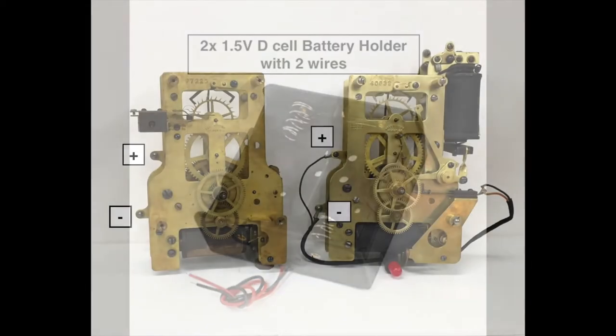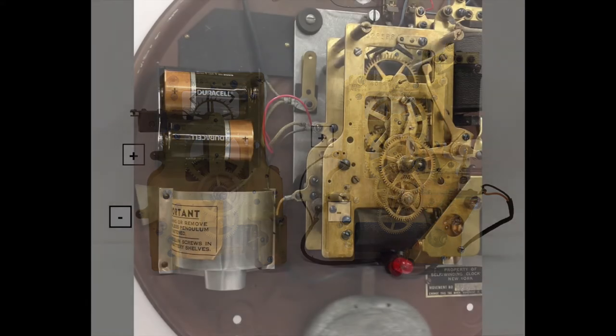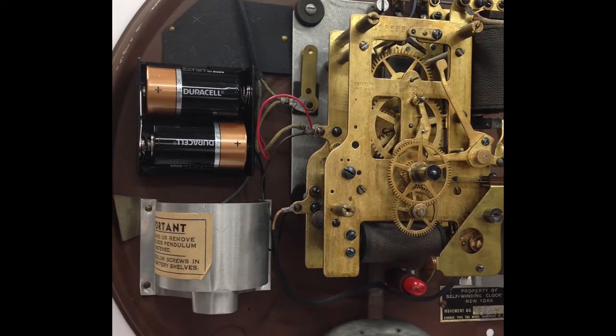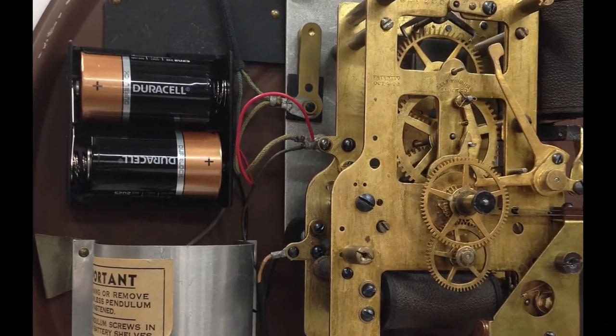The power is connected to the two terminals on the movement. Polarity is not important, but self-winding shows the positive to the top or switch terminal and the negative to the bottom or the coil terminal. This image shows how the power is connected. When a synchronizer is present, there's an extra wire on each terminal. The extra wire on each terminal is to power the signal light when the synchronizer is energized. An additional wire on the switch terminal goes to the wind tab to manually energize the wind motor to rewind the mainspring.